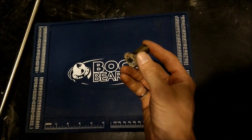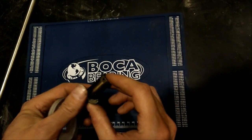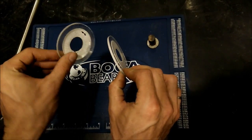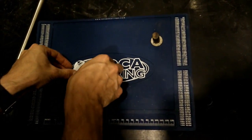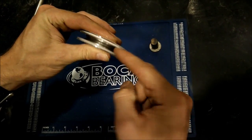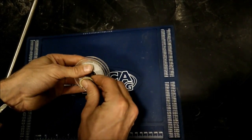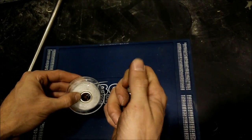We've welded together our own shaft cotter pin assembly. It has a washer on one side to stop it from coming out of the pulley, and then we put a real cotter pin in the other side. We also have our two recessed washers that we made using the laser cutter. The ball bearing fits in the side and actually overlaps the edge, so if the Kevlar rope comes up onto that, it won't slide off and land on the shaft — it'll land on the washer instead. We need to sand that down a bit more.